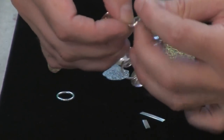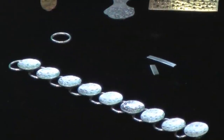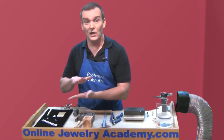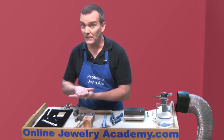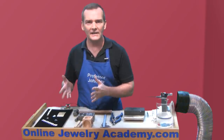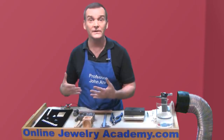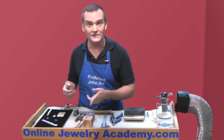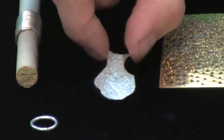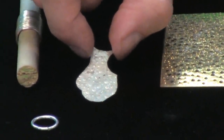Let's talk about what goes into making this beautiful bracelet. The first thing is the texture on each of these individual discs. I used a tool that I made along with 22 gauge sterling silver sheet metal that was fully annealed in order to create a really beautiful positive texture. If you don't have access to a rolling mill, don't worry — there are plenty of videos in our playlist that will show you how to make some beautiful and dramatic textures you could apply to the surface of your bracelet. Here is a piece of the 22 gauge sterling silver with the surface already printed onto it.